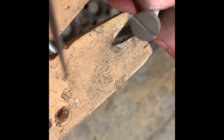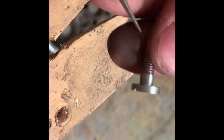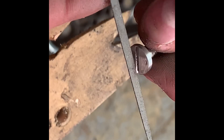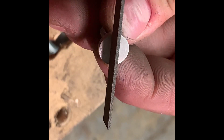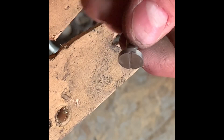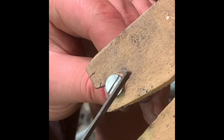It's quite a big screw so I'm going to put quite a large screw slot on it. I've messed up a number of screws getting to this stage, so any tips are welcome. The way I've always done it is using one of these files to start the slot, and then coming in secondly with the correct thickness width of file on top. I've taken it to depth and now I'm going to take it square with this file - that looks pretty good.